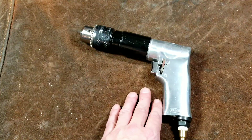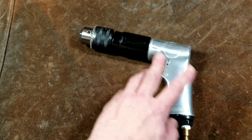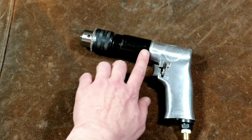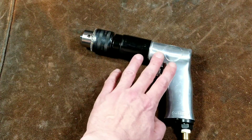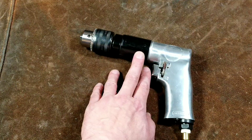It really just has a variety of issues. Also, when you want to rebuild it, a lot of these air drills are usually nice to rebuild — you just use, in this case, an inch and a half across the gearbox, and you can just unscrew it and clean it out, get all the metal particles out. But this one has a real hard time. You've got to get everything aligned just perfectly, otherwise it doesn't go together properly and binds up.